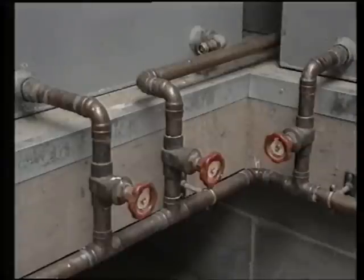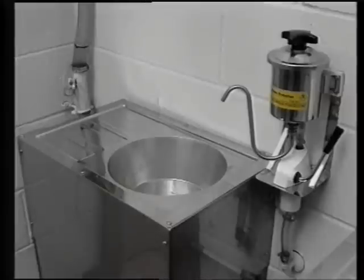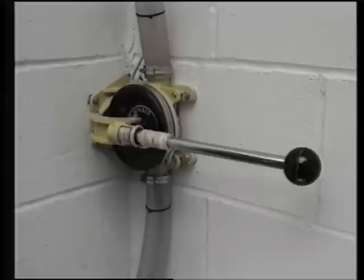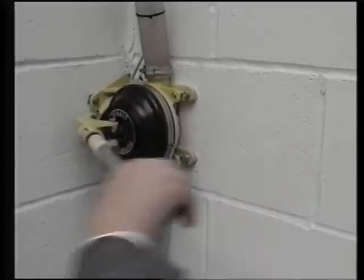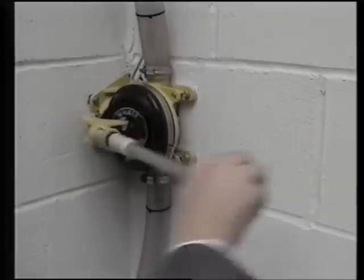Fibre glass tanks of the same size — 1000 by 750 by 1500 — are also available and comply with Bylaw 30. The ABP pump and filter draws its water from the storage tanks, ensuring a filtered supply at the point of delivery. The stainless steel sink tanks hold their own waste water. The washroom sink tanks hold 30 gallons, whereas the kitchen sink tanks hold 50 gallons. When they're full, the waste is pumped outside using a whale gusher pump through a 1.5-inch non-kink smoothbore hose, eliminating any need for large sanitation holding tanks.